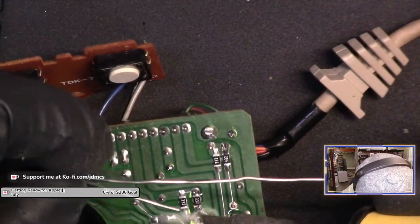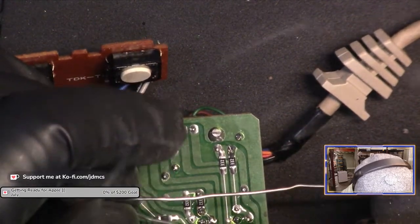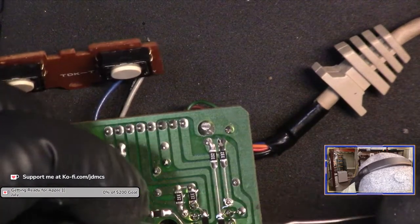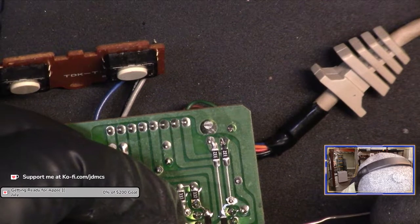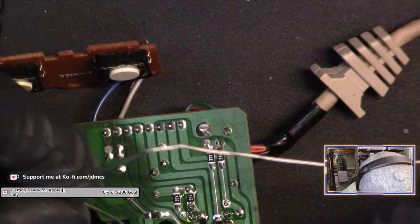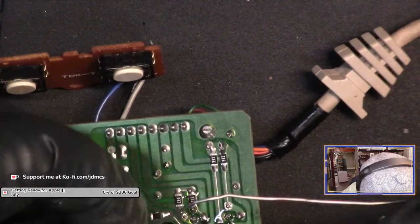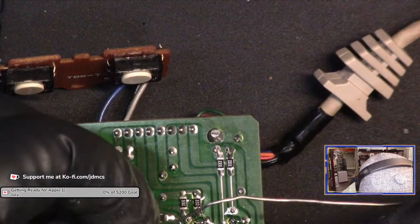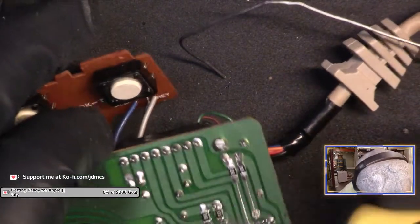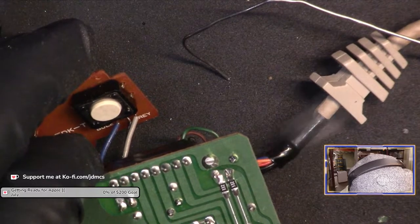So yeah, last week when I tested this chip using the voltmeter, because I didn't have any clips that would fit the oscilloscope, I can see why I thought the chip might be working, because I was seeing 0 volt to 5 volt transitions, but unfortunately what I would not have been able to see without the oscilloscope was that they were not happening at the pattern I would have expected.